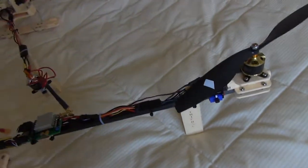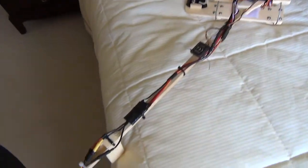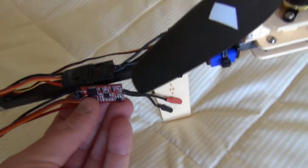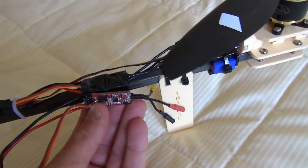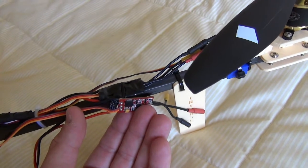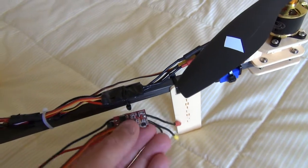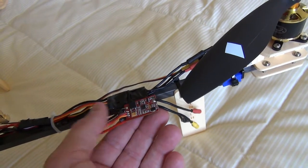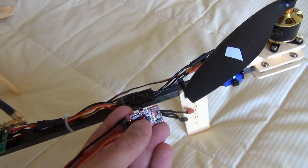All of the ESCs are mounted on the top, however the rear one I'd had mounted on the side for whatever reason. It was the part where the tilt dipped in the water, and the water got in between the heat shrink and stuck in there. If the heat shrink wasn't on it would probably have run off and I'd have been okay, but it shorted those out.